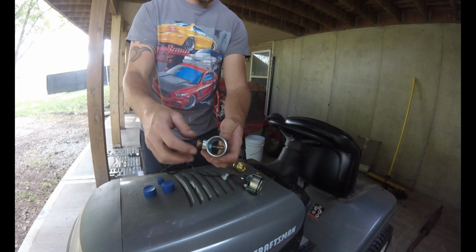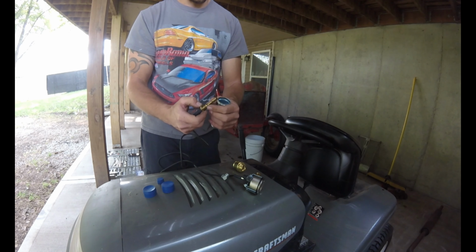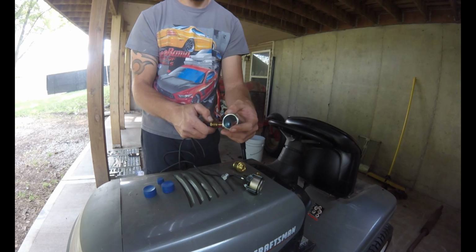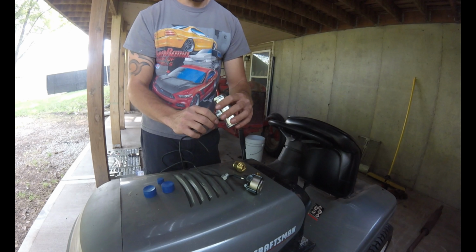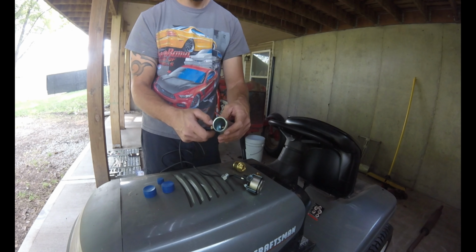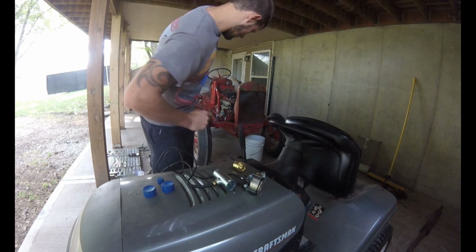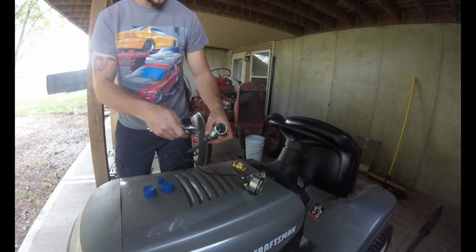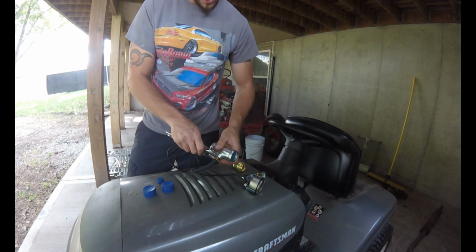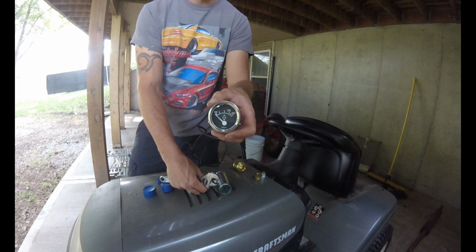Okay, so that's how we're going to run it. As you can see, it doesn't hit the bottom. We're going to go ahead and thread tape here. Well, it's actually an AN style, so it should seal up. Just hate to do this twice. Well, risk it. Get the biscuit. Okay, that's tight. And as you can see, gauge goes to 280.